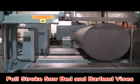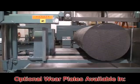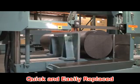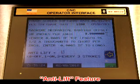Hydraulic operated, full stroke, saw bed and barfeed vises are 17 inches tall and have replaceable wear plates. Optional wear plates are available in hardened steel, aluminum, and armaplate, and are quick and easy to replace. Clamping force is variable and adjusted at the operator's console, and an anti-lift feature helps make straight cuts even when materials are slightly twisted or bent.